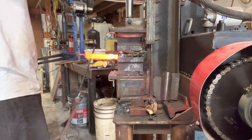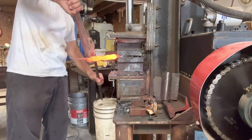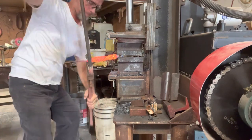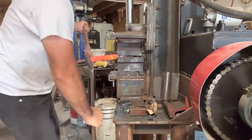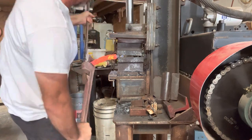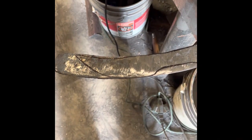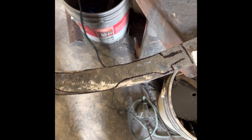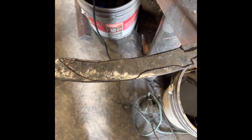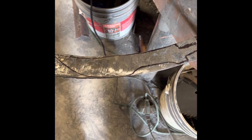As you can see here, I've decided the guard is going to be a twist Damascus as well — only 15 layers — which should give a good contrast to the blade itself. I don't want it to just blend in and look exactly like the blade; I want it to stand out a little. I've got the billet forged out with the blade shape drawn on. I'm going to do some stock removal to try to keep the core centered. The core doesn't have to be centered since all of it is still good cutting steel, but I think it'll look a lot better if it is.